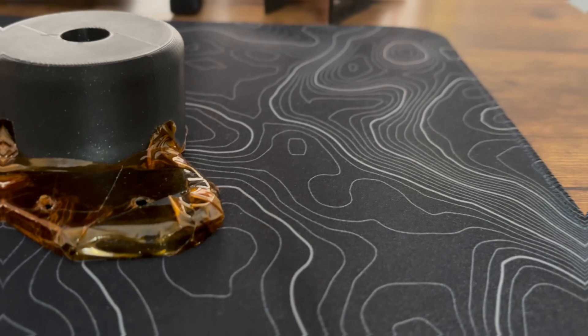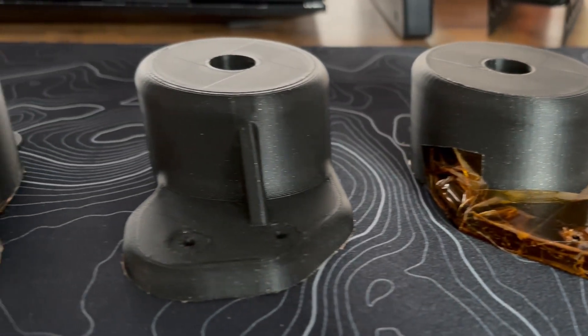For me, sometimes this is where I'll test out little blocks with different hole sizes if I have fasteners I want to try, or maybe an interfacing joint I want to print out to make sure it tests well with the part I'm mating with. This is a cool phase where you want to have enough of an idea flushed out to take it to print — or if you're fabricating it elsewhere, take it to the machine shop — to get those first lower-fidelity parts into the world and start testing. I'm a test engineer by day, so I feel like this is a crucial part for criticizing the design and working through pieces that aren't coming to reality the way you expected, then taking it back to the model and making updates at a lower fidelity.